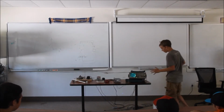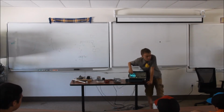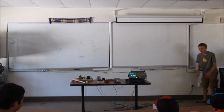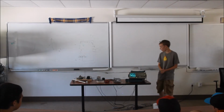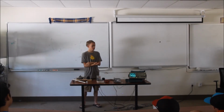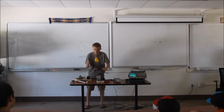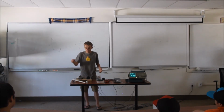So this sine wave is what the alternating current coming from the wall is. As you can see right here, the voltage when it's up here is the 120 volts that comes out of the wall. But then the voltage changes. It goes to negative. So these two little poles on the wall right here are constantly switching from positive to negative in this fashion, which is pretty cool because that allows you to transmit voltages for longer distances, and it allows you to use something called a transformer, which I'll also explain later, to step these voltages to varying different levels. So that way you can have voltages go from 120 volts through this thing called a transformer down to 40 volts. And this thing turns that 40 volts DC into 35,000 volts AC through this transformer.